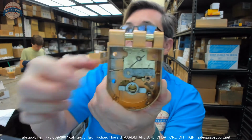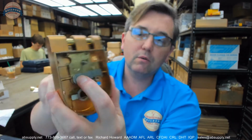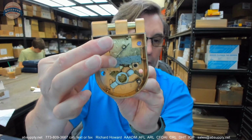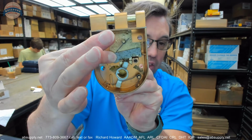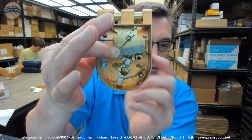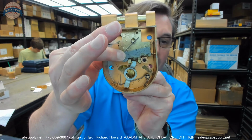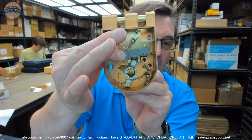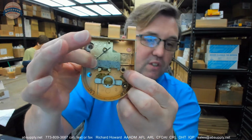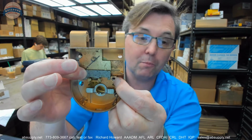so that the lever clears the fence. So what we're saying here is, to use some industry-specific terms, I'm going to hold my finger right there. As I rotate my key or my thumb turn, it lifts that lever, okay, and that notch right here is called, let's call it the gate, and that's the fence. And when I turn that, raising the fence out of the way of the gate, I can then slide my bolt. The problem is that post that the screw goes to acts as the ability to keep it in the firmly locked or firmly unlocked position.